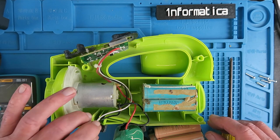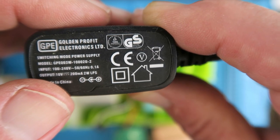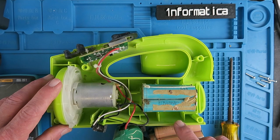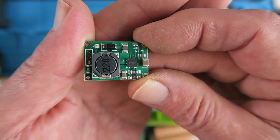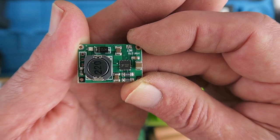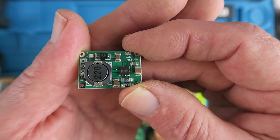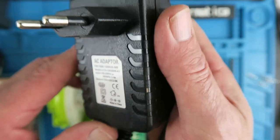The other thing that will need to be changed is the charger. The original charger as we saw is only 10 volts at 200 milliamps, and to charge these lithium cells we're going to need a dedicated charger. For that I'm going to select this board which I've used before — this is a TP5100 dedicated lithium charger. This will charge either a single cell or two cells and it's up to 2 amps, so that's perfect. What it will need however is a 12 volt supply, and I have a bunch of these 12 volt 2 amp supplies so that's not going to be a problem either.